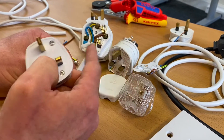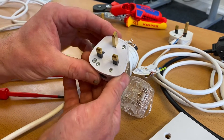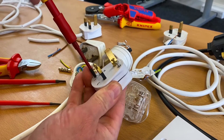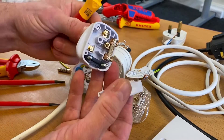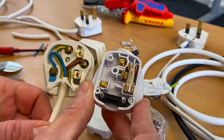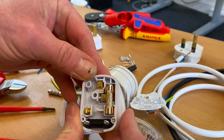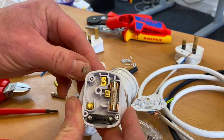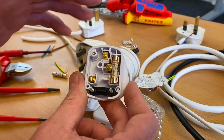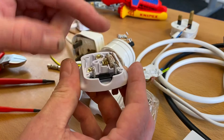This is slightly different from the previous video - we had an unscrewed cord grip and this has got a screwed version. The terminations are slightly different but in the same position. Let's open it up by undoing two screws to separate the back plate and access the connections. We've got our fuse in place with our line connection, neutral down here, and an earth symbol up here. As we said in a previous video, every time you see the word earth in BS7671 it means the greater mass - you often hear me calling conductors like CPC which is part of that family.